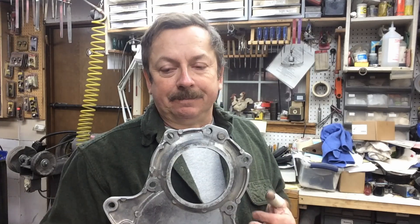I'm obviously not an engineer, but this is not a real complex subject. Common sense tells me that we're changing the oscillations on the crankshaft — changing the harmonics. There's going to be somebody with a better explanation than me, but anyway, we're reducing the loads on the crankshaft itself and shifting them out to the end of the crankshaft extension. We're not going to eliminate those stresses — we're just going to reduce them and transfer them to a different area.